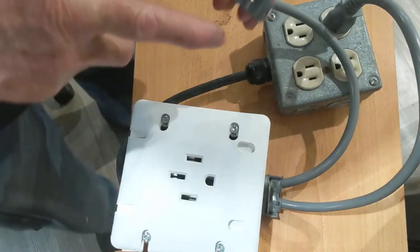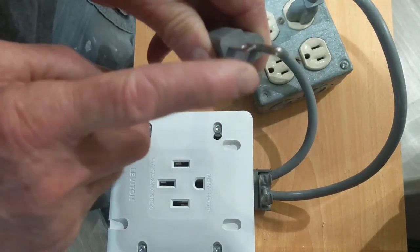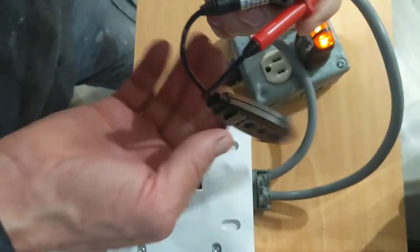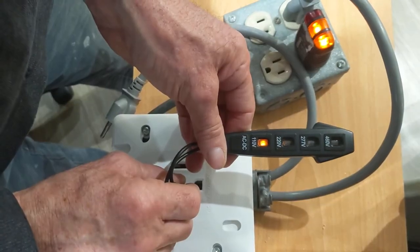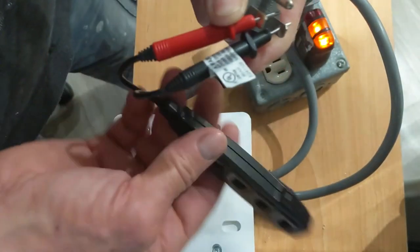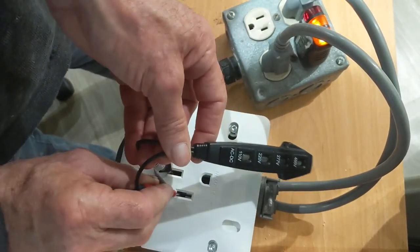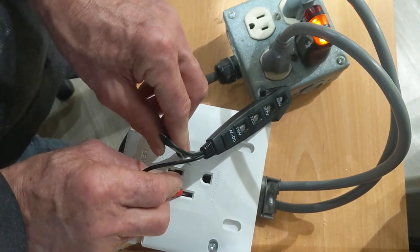Just to answer a question: if we unplug one side, what happens to the other side? We're not gonna have any power in there. Just to clarify — there would be no power in this leg if the other one is unplugged. Plug this in — you see power is there. And I can check this one in here — nothing. You guys can see on the box I have 110 coming through, you can see 110 right there. So this other leg I don't have power going through it, ground is connected. If I plug this in on the same hot leg from the panel, I'm gonna have just 110 — it's the same leg. So here I have my 110, and this other side too I have my 110. And if I go here, these two sides show me nothing — that means they are just on the same leg on the panel.